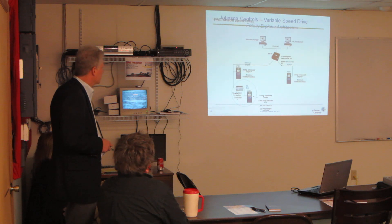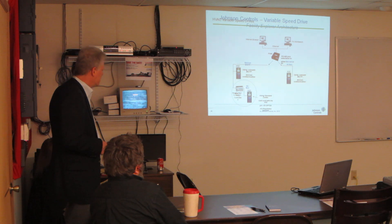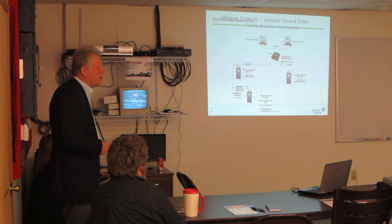We also have LON too. Again, these can sit on the SA bus — that's the biggest thing. Or you can see more now: BACnet MS/TP, which is kind of neat, or regular BACnet IP.